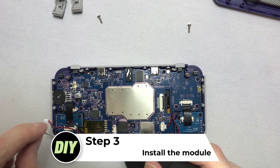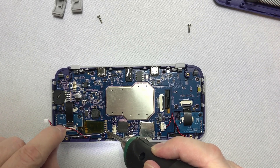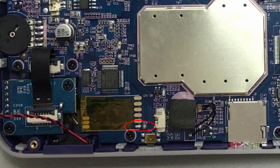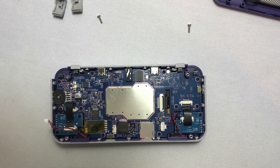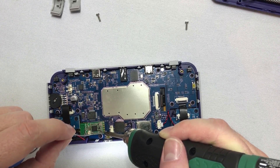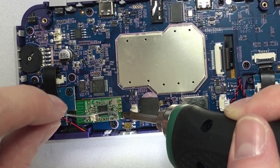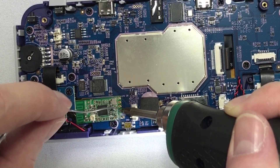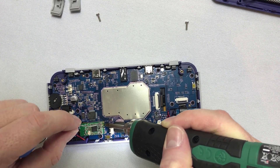Now take your soldering iron and heat up the golden pads by pressing the iron to them gently. From time to time test if the solder melts by tapping the solder to the pad and the iron. As soon as you feel it melting, put a small blob on the first pad and leave the others empty for now. Then position the module to the spot and place the soldering iron so that it contacts both the pad on the main board and the module — as the solder melts, the module will make contact with the main board. Repeat this for each remaining pad: place the iron so it contacts both the main board pad and the module pad, then put a blob of solder until it melts to both and makes a connection. Repeat until all pads are soldered.